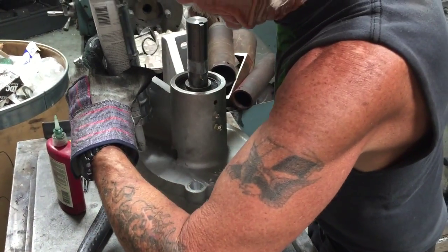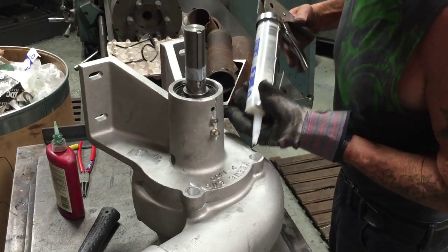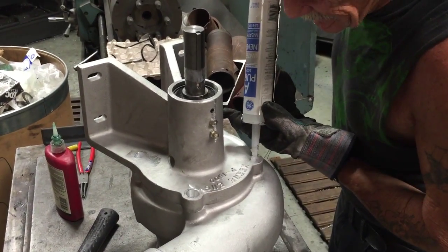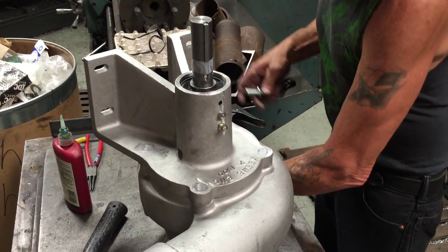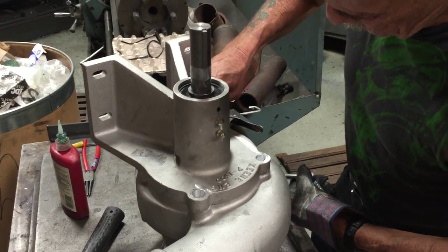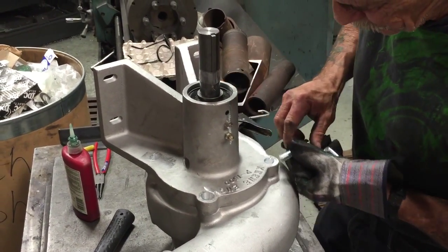You only actually need to do three of the holes. The bolt hole at the top where the discharge of water is — that's a sealed hole, it will not leak. Put your bolts in with washers — half-inch bolts, two inches long with your half-inch washer.